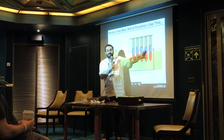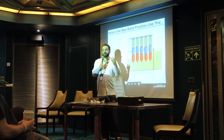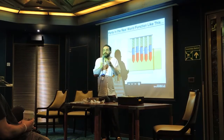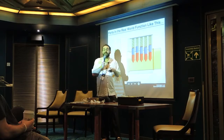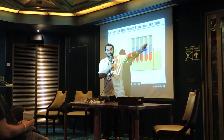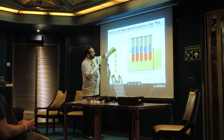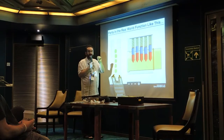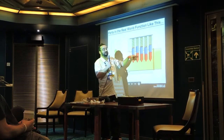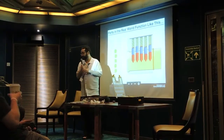As you lift it up, once it hits that shear line, suddenly click, you feel it, you hear it, depending on the lock, and depending on your skill set, you can either feel it, hear it, and with the transparency, see it. And the driver pin stays at the top, and the key pin drops down. And it stays at the top because now it's sitting on a ledge, tiny small ledge instead of dropping down. And then one of the other pins will start binding. And you go through it again. And you go through each individual pin.